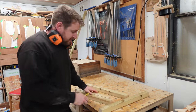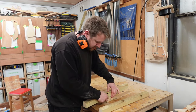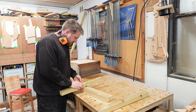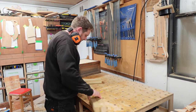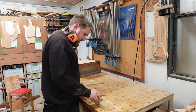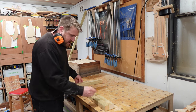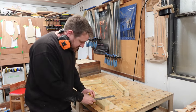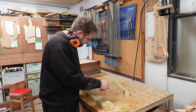So we'll mark this up for a simple halving joint. So that is literally, we're just going to have on these two, the two shorter ones. So it's just the width of the timber and then halfway down. And then this one is going to have, it's going to be marked up like so. So we're going to have halving joint on the back. And then the halving joint set in, let's get a square, set in the right distance, the 46 or whatever it is. From there,